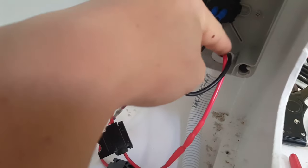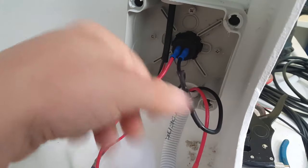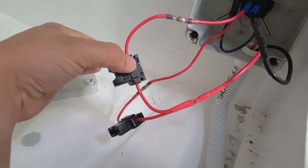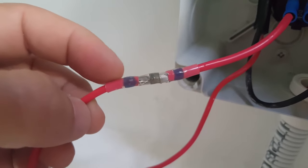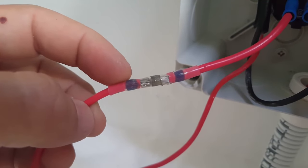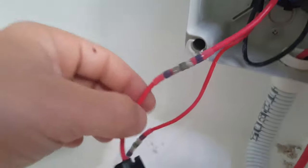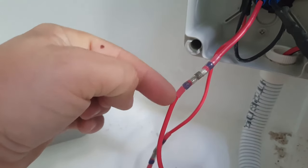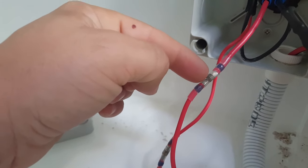In the aft cabin, because it's really small, I'm going to do a shared load. The 2.5 cable comes in, there's an insulated connection, a second connection, and two fuse holders. I use these waterproof solder connectors - the blue part is the water seal so it's waterproof. They call it low-temp solder but the heat gun gets really hot before these things shrink. You've got to add quite a bit of heat to get the solder part to melt. Then it runs up to the light.